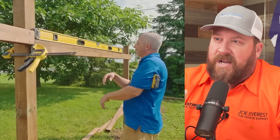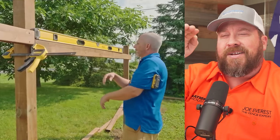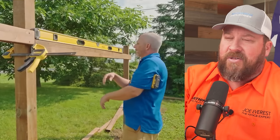He's going to come back and nail pickets on this — we'll review that in the next video. But the picket that goes over this intersection — I don't understand how this is going to look any semblance of professional. There's going to be a picket come close to where this one rail steps down. Are you then going to step the pickets down to match it? He had talked about the 6-inch reveal, which is absolutely important — but which of these rails do you measure off of for the 6-inch reveal? Does each panel step down for all the pickets? I don't know how this is going to end up looking.